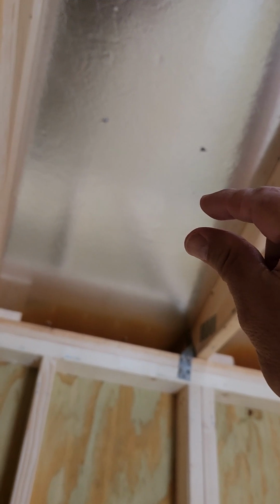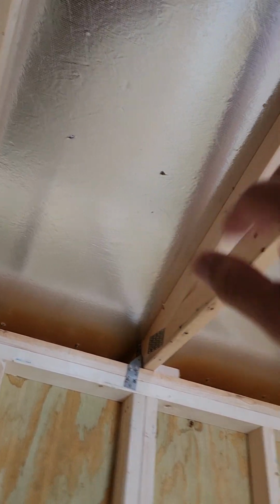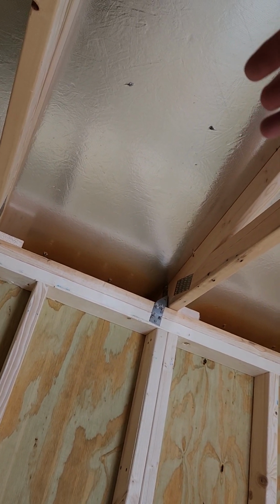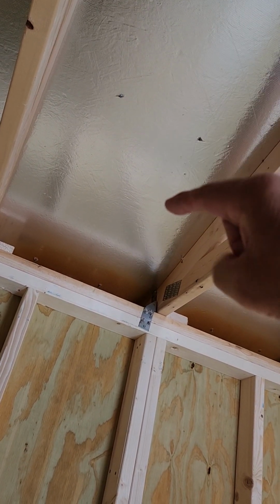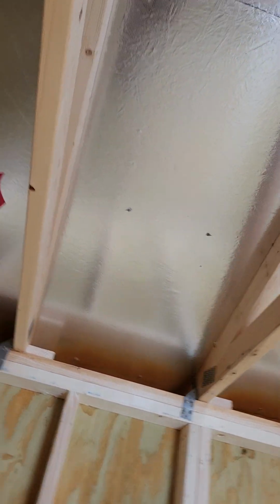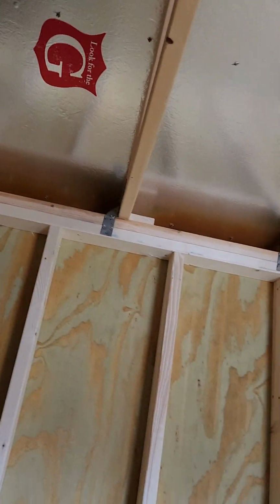They use these little 1-inch wood slats, but we use roof decking like you would build if you hired a builder to do a roof for you, okay? On the outside of the roof decking is the metal roof. Between the metal roof and the roof decking is a moisture barrier. And then on the inside of this particular roof is the upgrade of the radiant barrier roof, okay? So this is a great roof with an excellent ventilation system.